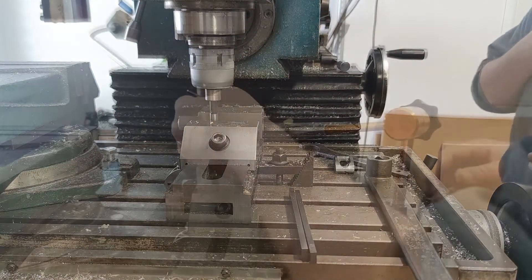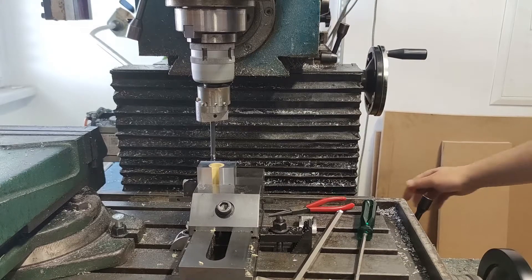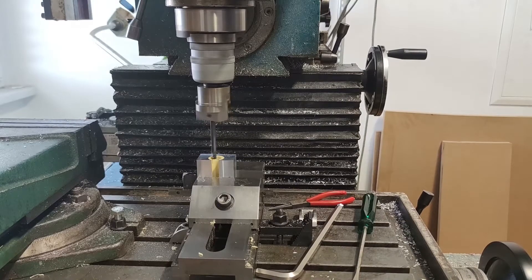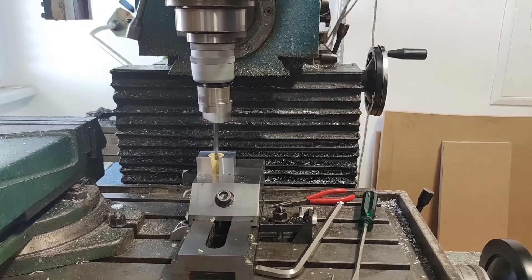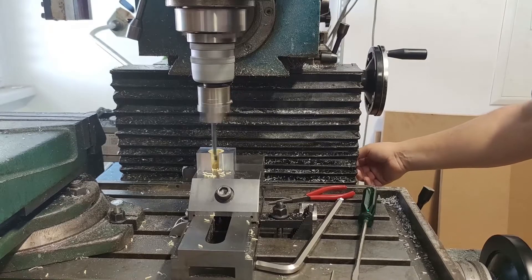I did all the boring with the machine position locked in place. The length of the boring bar was adjusted for the highest rigidity so it barely came through the hole. The first pass was quite undersized so I was able to establish the first known diameter of the boring. I then adjusted the head accordingly. The head does not have any graduations but the screw has fine thread and each turn advances the cutter 0.5 of a millimeter.